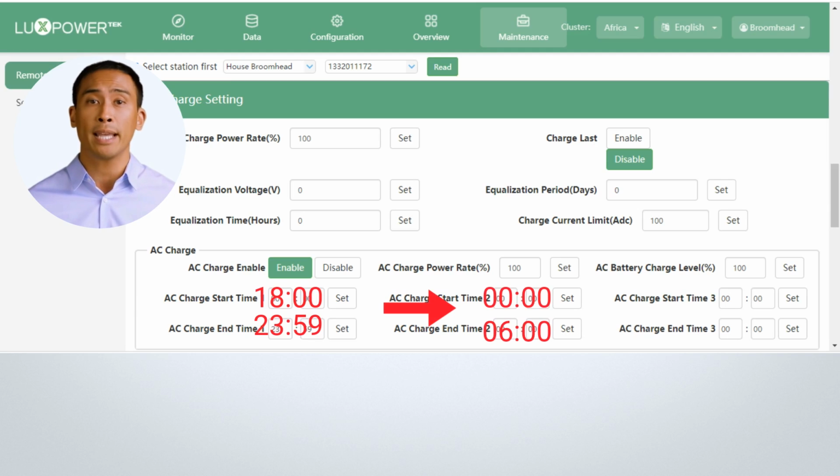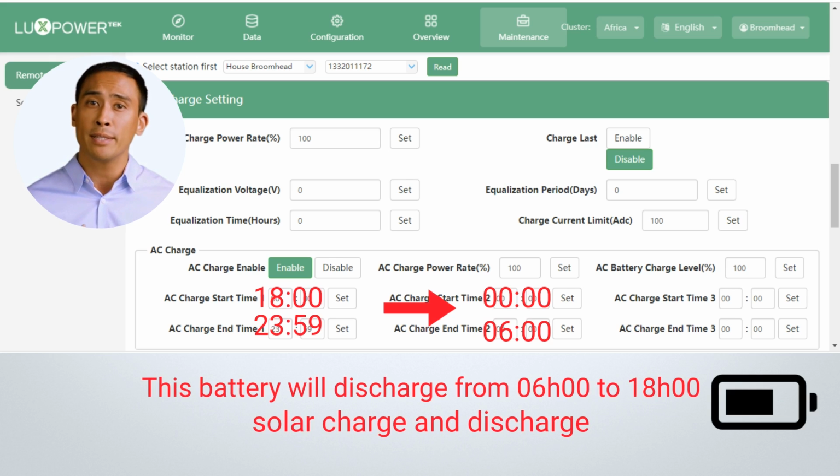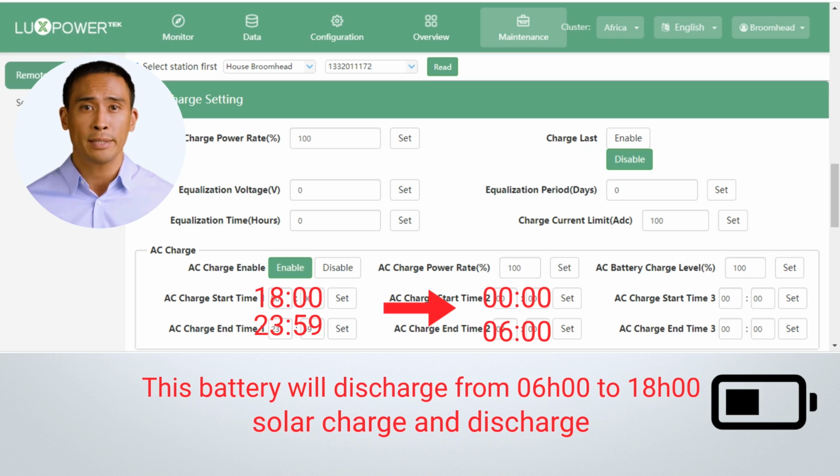Also remember that any gaps in time will allow the inverter to discharge the battery if the on-grid EOD setting allows. And if the grid power is on, the battery will discharge to the non-essential side as well, and recharge from solar only if there is sufficient PV.